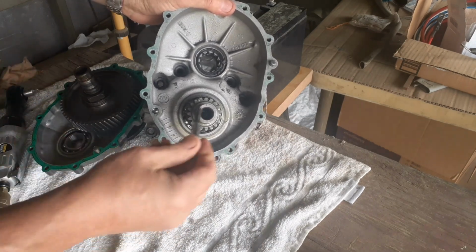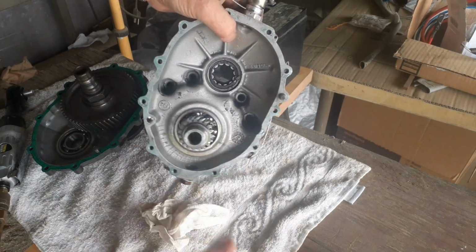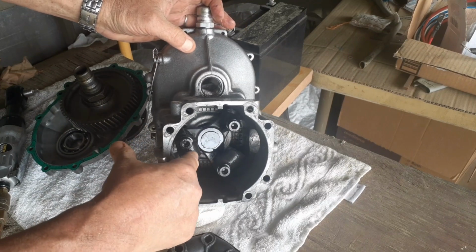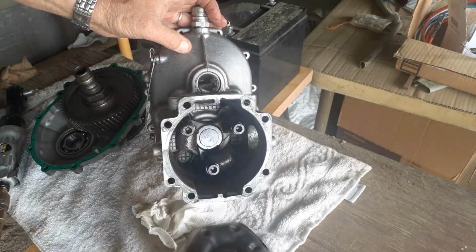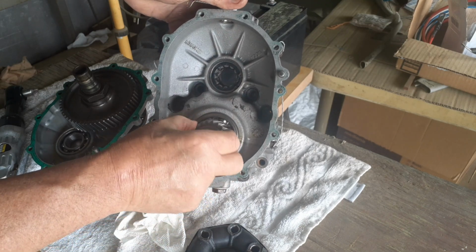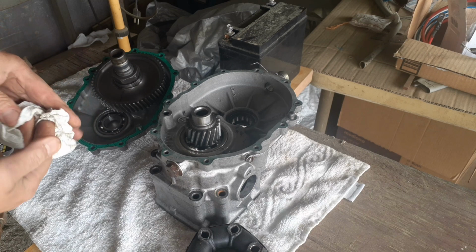And I'm going to try to get it off with my pneumatic wrench, and hopefully that comes off. I'll be able to put the new donut on the spline, and then with the spline out of the box, take it to the engine and bolt the rest of it to the engine. Then I can slide the case back on the engine, torque the inner bolts, torque this set screw inside there, and then put the other half of the gearbox on. So that should be the plan for today.